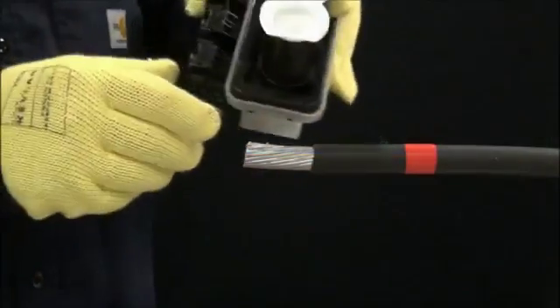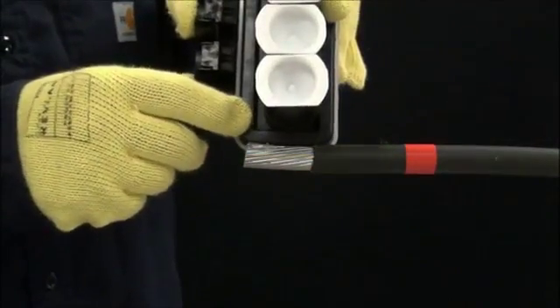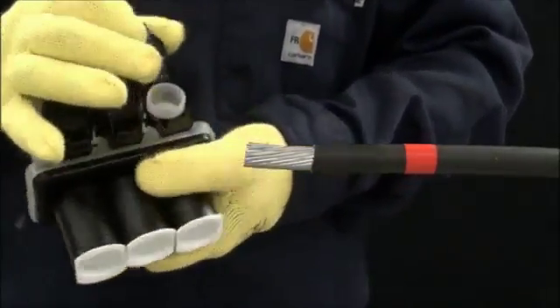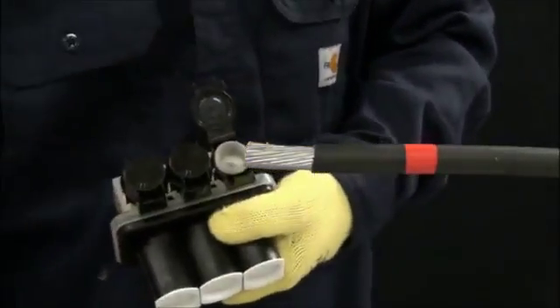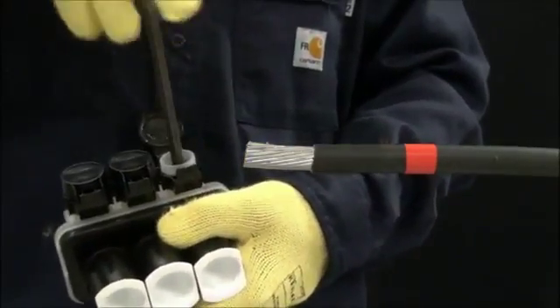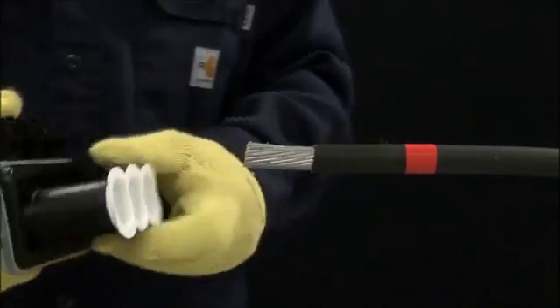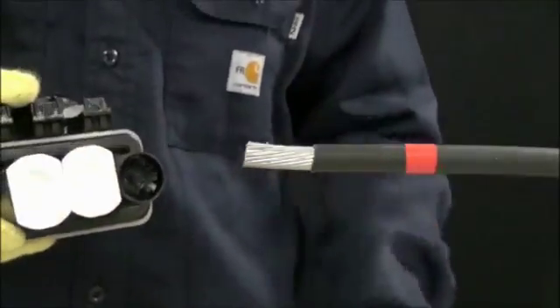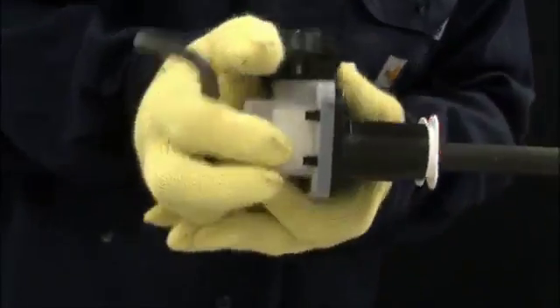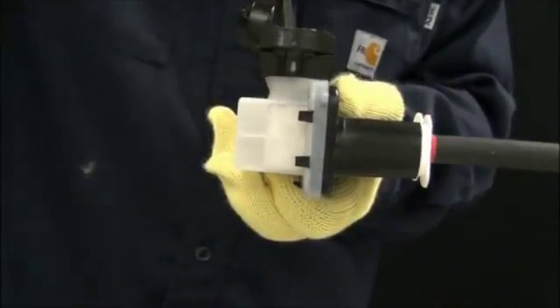Using the strip length guide on the connector, remove cable insulation. Snap open the screw cap using your fingers or a small flathead screwdriver to open the latch. Using a 5/16 inch hex wrench, rotate the screw counterclockwise to raise it approximately three quarters of an inch. Remove the port cap.